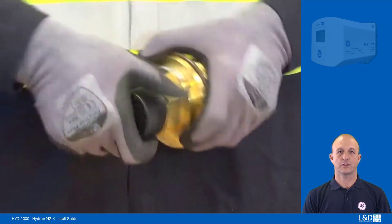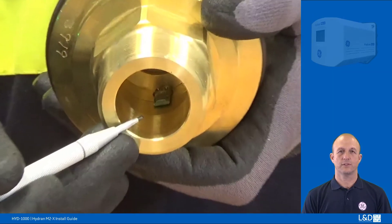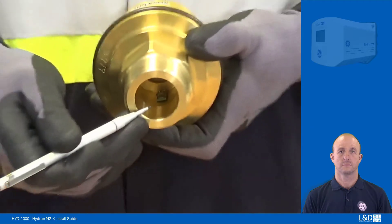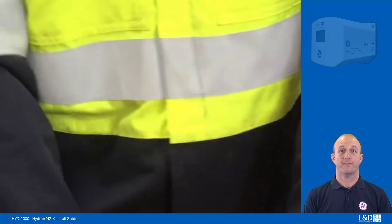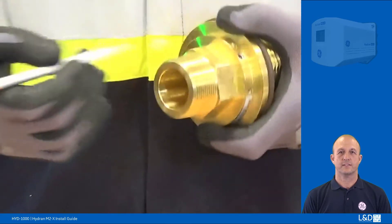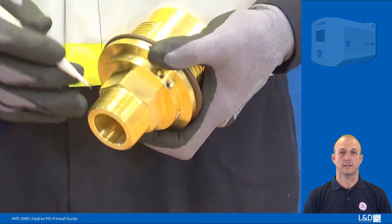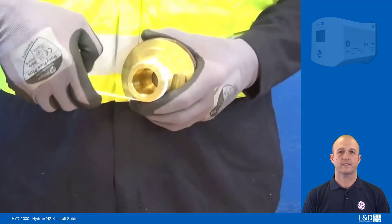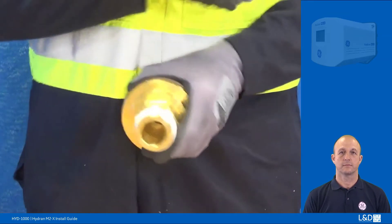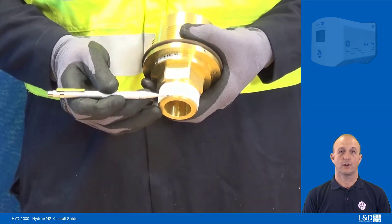Now to prepare the sensor for installation. Remove the plastic cap and ensure the threads are clean and undamaged. Looking inside we can see the moisture sensor at the back and the opaque gas filter — do not try to remove or damage these parts. Next, apply sealing tape onto the sensor threads; this is to prevent oil leakage between the sensor and supply flange. Apply the tape in the direction of the thread — on this sensor it is clockwise — ensuring that no tape overlaps the first thread, therefore reducing the chance of tape getting into the sensor. Normally three to five wraps is sufficient. Cover the whole thread, then break, pull the tape and smooth down any loose ends. Confirm that the tape is wrapped sufficiently tight to see the profile of the threads and none is overhanging the first thread.